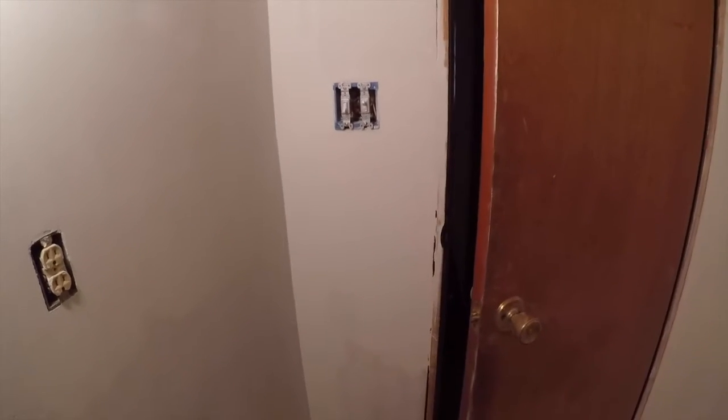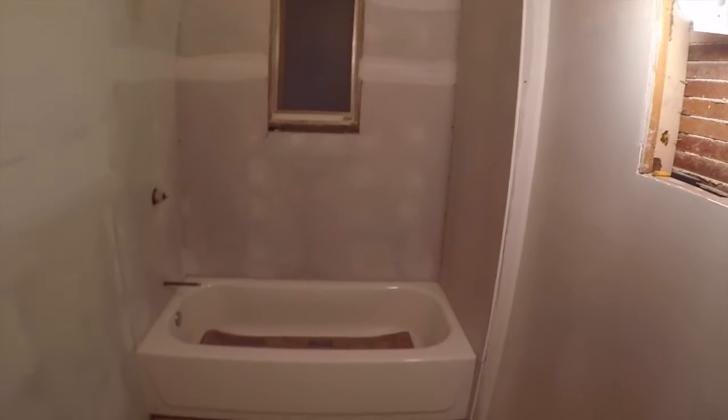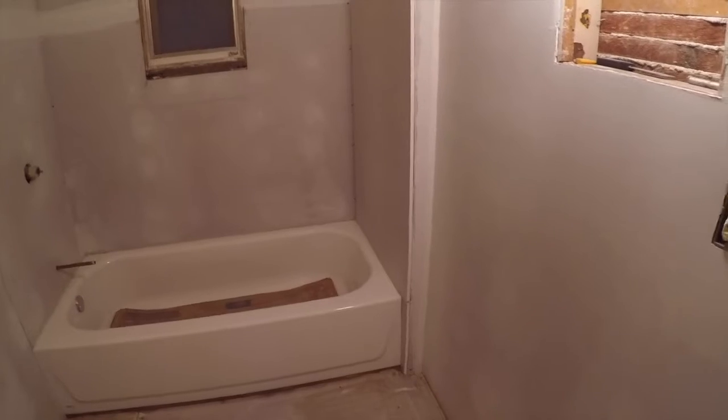And that's pretty well going to wrap it up. Finish this wall. Just one more coat below the light fixture there to fix a couple of imperfections and blend that in with the bottom part. One more episode of sanding, and then I'll be coming in here to coat all of the sheetrock and the new plaster with a paint primer, and then I'm going to paint. I'm going to paint all the walls, everything with the exception of where the shower unit is going to be installed. And then once the painting is done and dry, then the next step will be to install the shower.